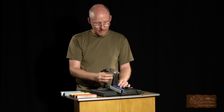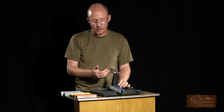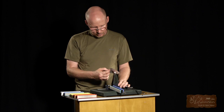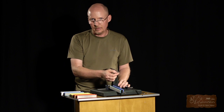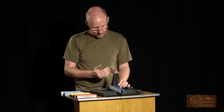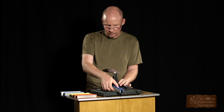If you wanted to get a little angle gain at the tip and have a little wider angle, you could bring it back in even farther. And if you wanted the tip to be even sharper, you could push it out. The thing that you're going to end up with in that case is that the bevel is not going to look nice and even all the way down the edge. So that's what this technique is really for, is finding that location where the bevel is going to look nice and even for you all the way down the edge.